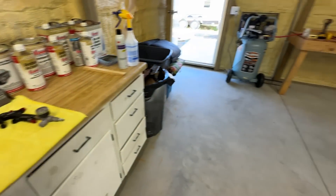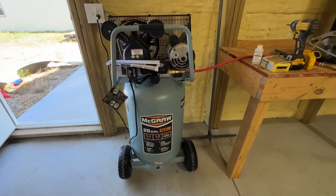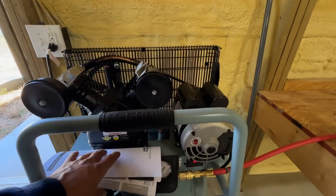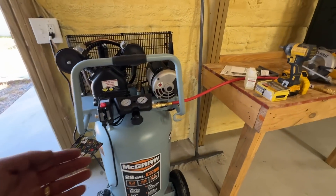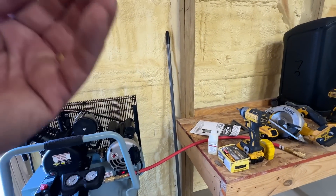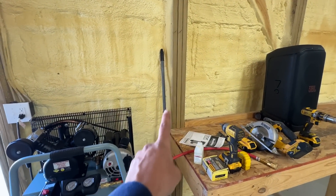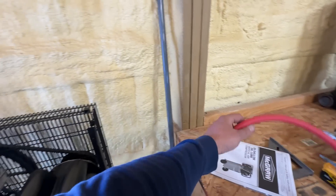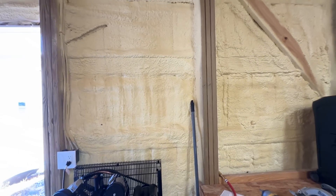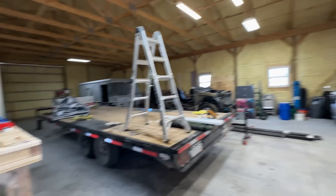To make air pressure, let's start right here with our new McGraw 29-gallon, 165 PSI oil compressor, just from Harbor Freight. It'll be pushing air out, and whenever you compress air, it heats up. And then when it cools down, it has the potential to condense — water comes off of it. So you need to find a way to dry it. Where we're going to run our dryer is basically off of this hose right here, this short three-foot hose we got from Harbor Freight. We're going to connect it up to our copper tube air dryer, run it across the top of our barn and then down over to a reel. Let's take a look at those parts.